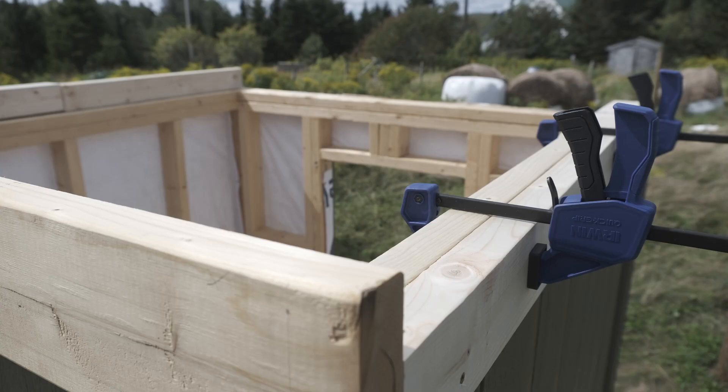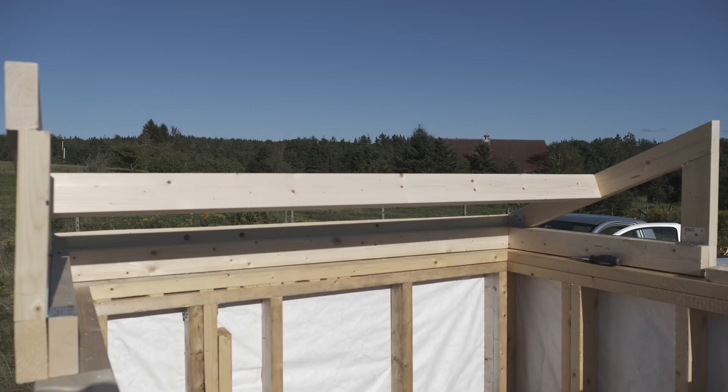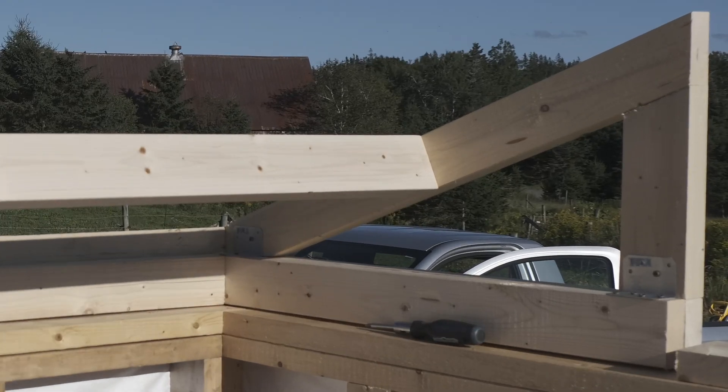Then an outer frame is attached to the inner frame. The outer frame will hang a couple inches over the walls to provide a drip edge. There will be only two trusses on the outside of each side of the split roof, and a center strut must be cut and shaped with the upper part to a 24 degree angle, and then rafters cut and shaped to fit that part, with vertical inner edges at a perfect 90 degrees to the plane of the ground, and the low ends carefully cut and shaped to fit perfectly to the broad rim or fascia of the roof.